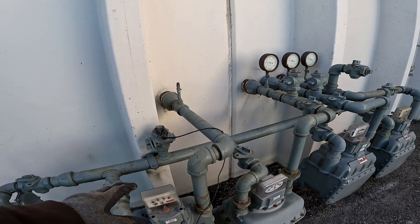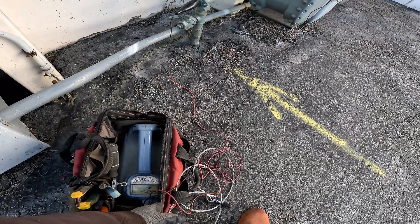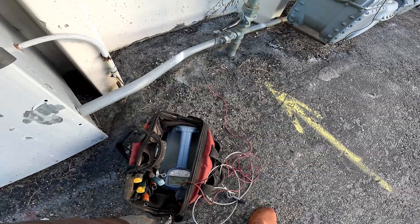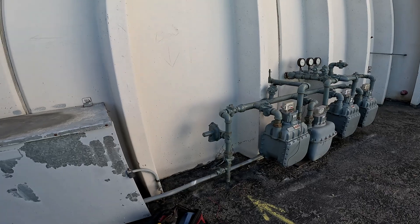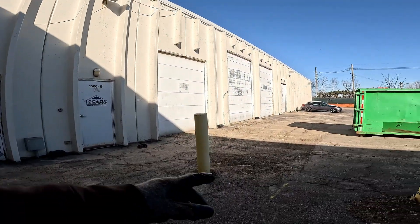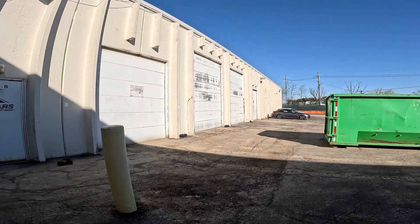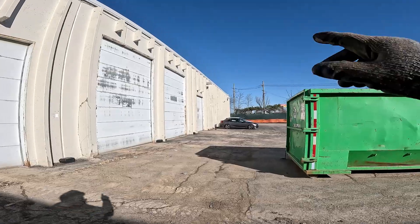You can hear the box going and you can see the sparks flying — that confirms it was my ground connection. Now that's a good ground. I'm pushing out 100 milliamps and my voltage is 1.0, which is really good. I've got a good connection to this riser — a really good connection. This service should take me out singing all the way past the fence where the mains are.